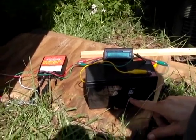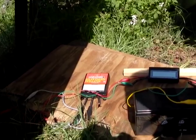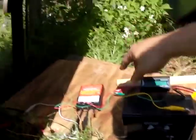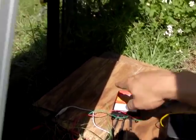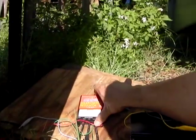The 7 amp hours and the 7 amps on this have nothing in common — it's just a coincidence that they both have the number 7. The amp hours is the length of time that you can run this; the 7 amps is the maximum current you can run through the controller. You don't want to exceed 7 amps on this, which is about 100 watts at 12 volts — actually 84 watts — but you don't want to go over that.